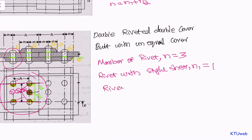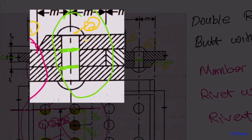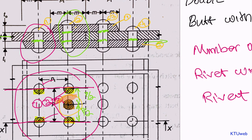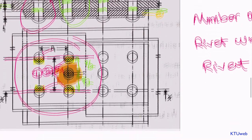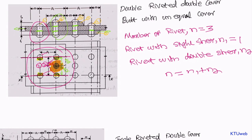For the double shear case, rivet number two is in double shear — it obviously has two covers. The middle rivet number three, which is behind rivet number two, also consists of two covers. That means rivet numbers two and three are both in double shear, so n2 is equal to two. And we can write n is equal to n1 plus n2. This is a special case — remember, when the external rivet is outside of the top cover, there will be a single shear situation in a butt joint.